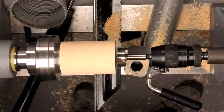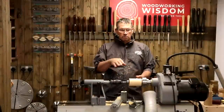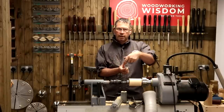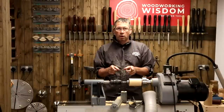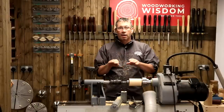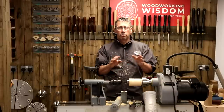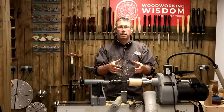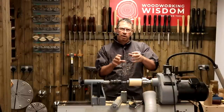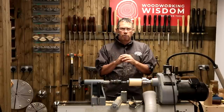So do your tenons. So rough down to a cylinder at final size with a nice clean cut. And then whatever the diameter you have there, mark with dividers each side and then cut down with your parting tool. So you have the same length to diameter, and then you can start your rounding process. Round over almost to your cylinder, then move 90 degrees between two cup centers, and then follow the ghosting. And then just keep moving it every inch or so at a time until you get it spot on. And you'll find that it won't take too long.